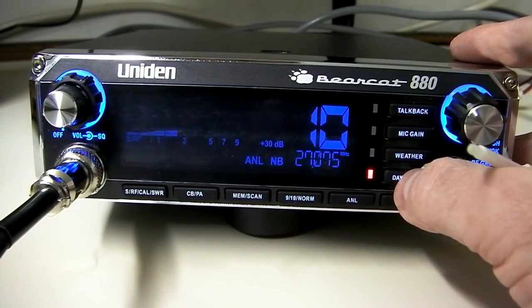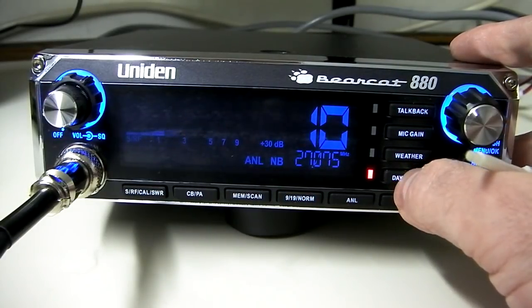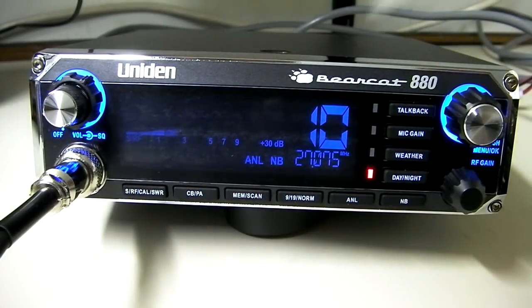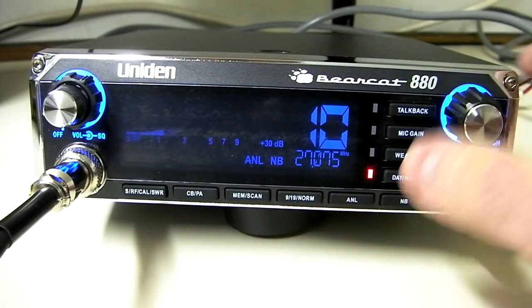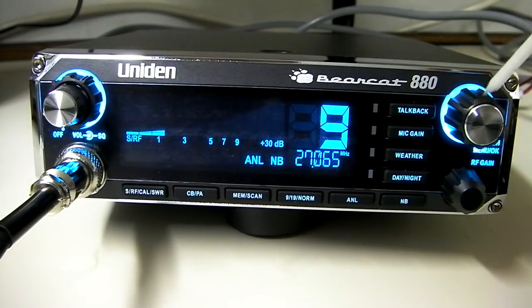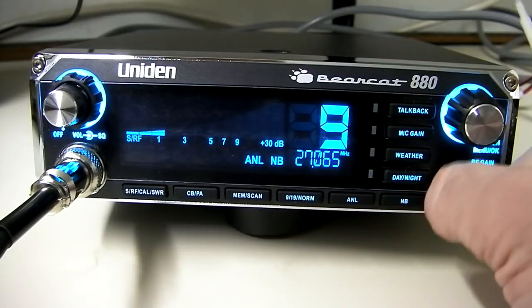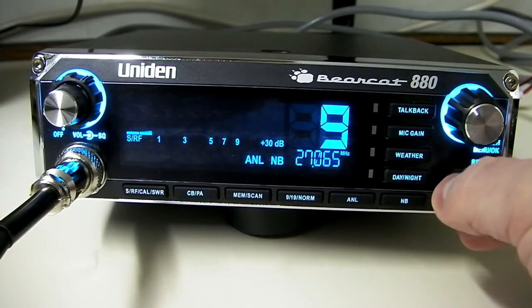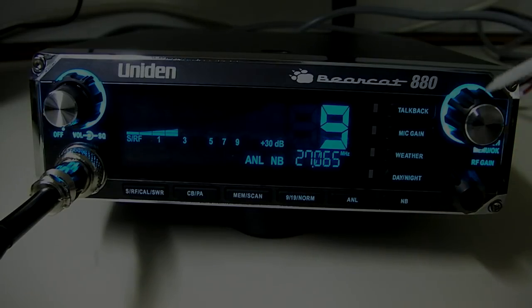Day and Night flips between day and night display options. The idea is that during the day you want a brighter display and at night a darker display. This can also be set up for different colors — your day color could be a reddish color and your night color could be blue, or vice versa. They can both be the same brightness; it's fully adjustable. The channel changing button also serves as your menu button — press it in and it takes you into menu mode. Just below that is the RF gain control, a standard pot for variable control. If someone is really close, you can turn RF gain down so their signal won't blow your ears off through the radio.